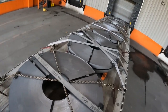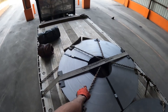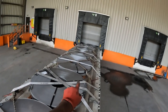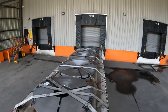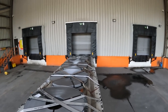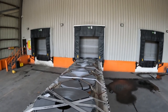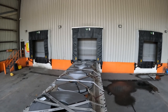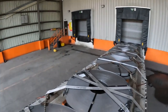And I just did that all, well, no, I didn't do that all the way down. I didn't do A chains all the way front to back. There's an A chain in the very front skid right here, and in the very rear, the one in the very back. And that's doing the same thing, keeping the skid from going backwards off the trailer, which really, for that to even happen, you'd have to be reversing really quickly, and then go to a dead stop to risk that happening. You wouldn't really come into contact with something like that, most likely.